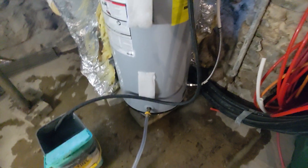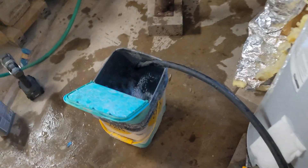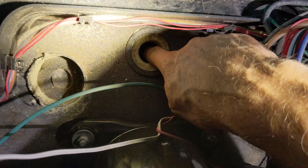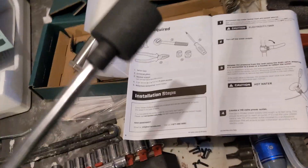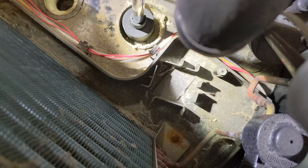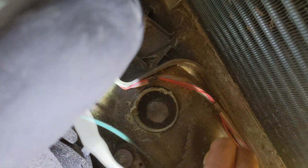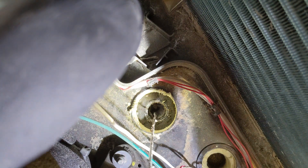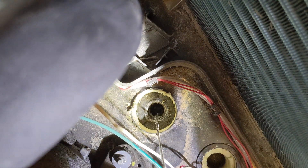I'm using a hose attached to my pressure relief valve to siphon CLR into the tank using a transfer pump. I flushed it three or four times to get all of these crusts out and then removed the lid. It was the part that freaked me out because I couldn't figure out where the anode was — it's the one on the left. Using a 1 and 1/16th head and an impact driver I was able to loosen it and eventually pull out the sacrificial anode core. I was still running a flush at this point, so letting that stuff drop was okay.